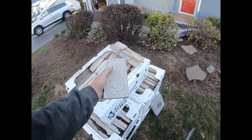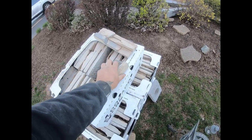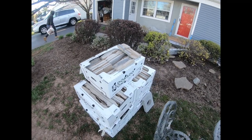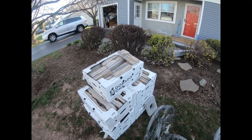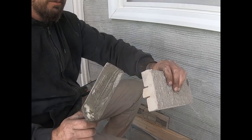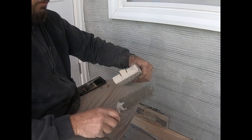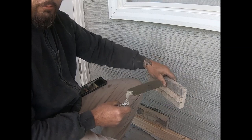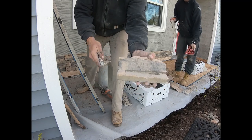This stuff goes a long way. If the back of the thin veneer stone is pretty smooth you're definitely going to want to go heavy on that bonding agent. If it's real rough you could stick it up with almost anything, but like anything else — if you have smooth surfaces, get that bonding agent in there. Sometimes there's a little extra mix hanging off the edge; just scrape it off because it'll hold you off from laying it flat.